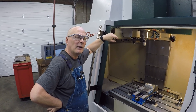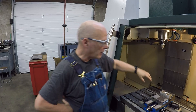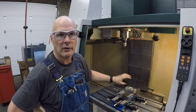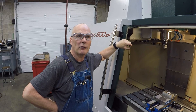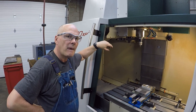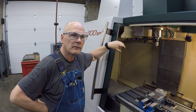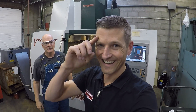I don't know how flat you get the floor thickness relative to the outside wall when using glue, but if you've decked it off and bolted it down, as long as you don't get any chips in there it's going to be really flat. To the point about vacuum chucks — if you've got a large one and you're taking the part on and off the machine, you need to check it or potentially re-deck it at some point, and you've got time and money in those vacuum chucks. As always, I appreciate Paul's time — it's a pleasure to be over here again. Take care folks, see you soon.